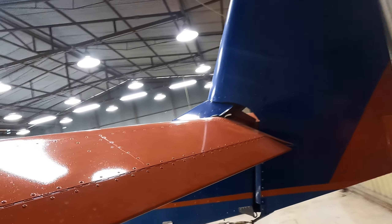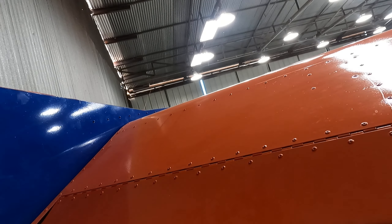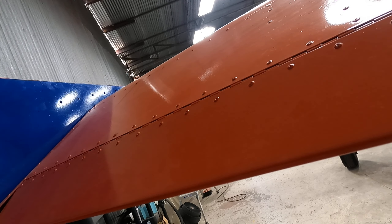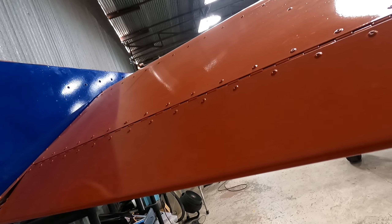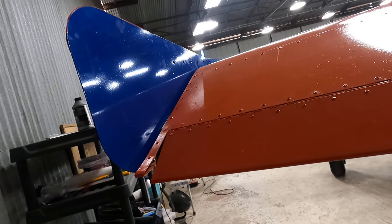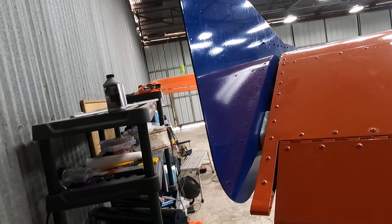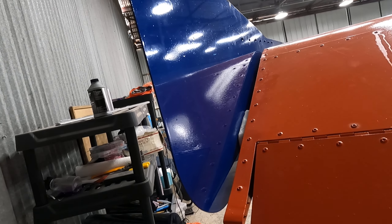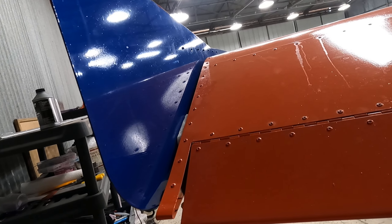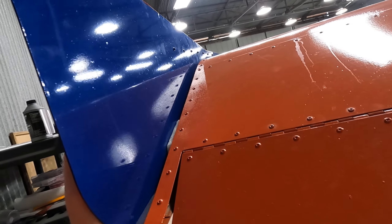I was still concerned, so I did a test run with just Clicoed on and ran up and down the runway at taxi speeds. I could tell that this would bend in and rub against the end of the plate. So what I did, I got a nylon block — it's actually just a Walmart nylon cutting board. Cut a piece off, countersunk it, and made a tab. That gives you a rub strip so that this won't bend into the horizontal.